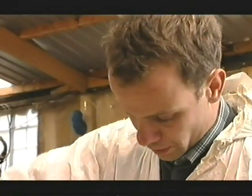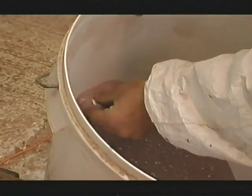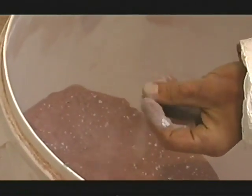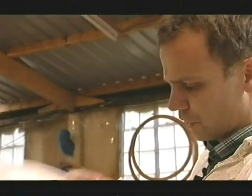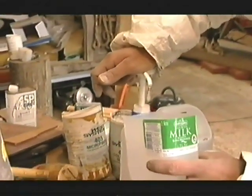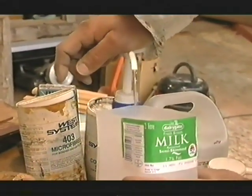The third one being this low-density filler, which is this lovely purple stuff, which is quite hard to mix in, but gives you a lovely, lightweight filler, so you don't put on too much weight. As you can see, it's dusty, so you've got to watch that. Wear a mask. So what we're going to do is mix up some resin, then add the correct filler.